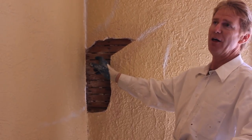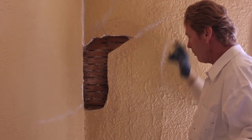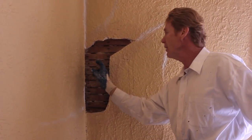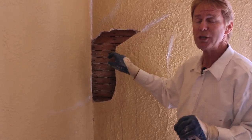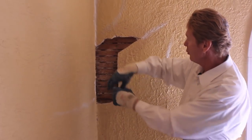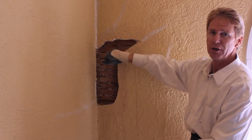They've got old timber lath — you can call it redwood lath, all it is is furring strips. You've got your studs coming down and the furring strips are on that. The mud adheres by mushrooming through these keys — it goes through the other side, mushrooms on the back, and that helps it adhere.